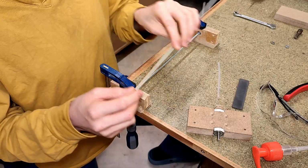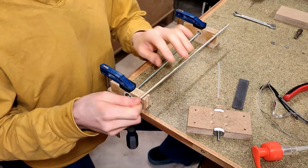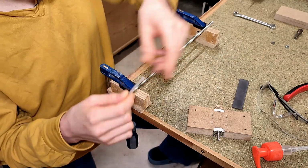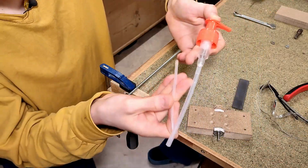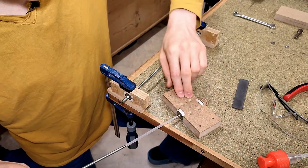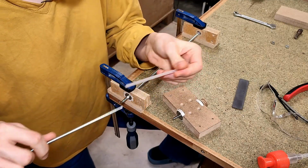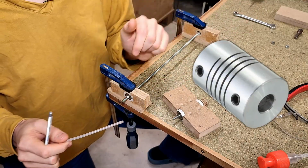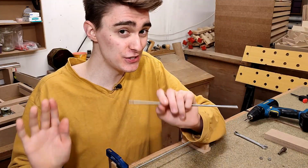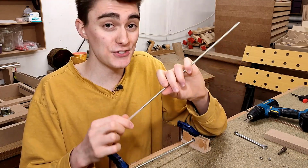Did the same thing with my lead screws, turned them into a makeshift lathe, using decent quality bearings, and ground this little smooth section on them. Now I can use a piece of this plastic tube from a soap dispenser pump or whatever was in it to connect them to my arbor, just like so. Another huge advantage of this approach is the plastic tube is slightly flexible, just like those aluminum coupler thingies people always use to connect stepper motors to lead screws. Of course, that could introduce slipping, since the tube is really just a light press fit on there, but I guess we'll find that out soon enough.